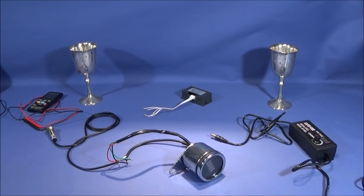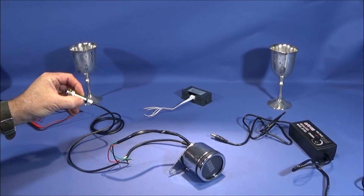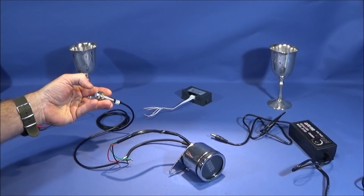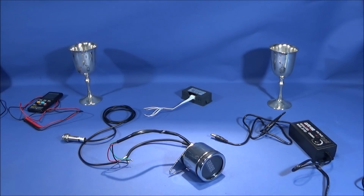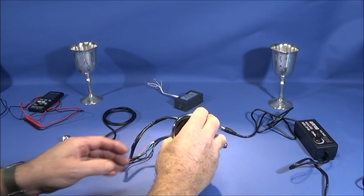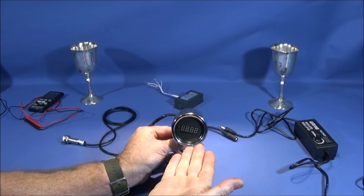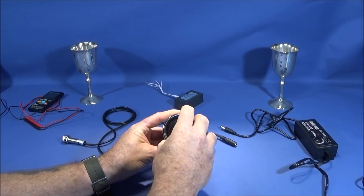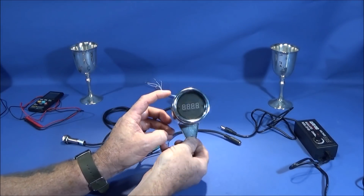That instruction paper gives you the wiring for the tachometer, the proximity switch, and also details about the way the magnet should face the proximity switch. The great thing about this tachometer is you can buy it and use it straight away as it is, because all the electronics are encased in this lovely chrome housing and you can just bolt it straight to a machine or another surface.